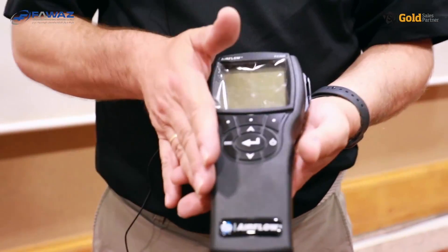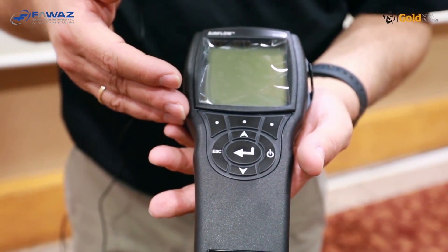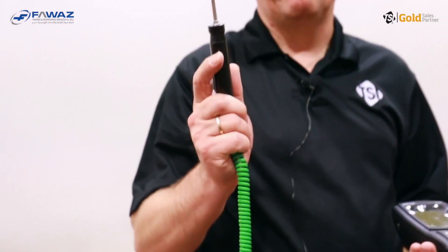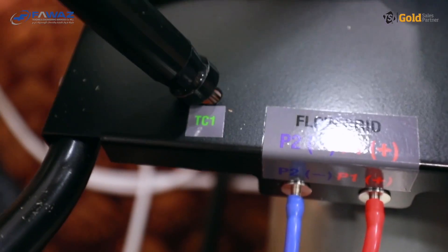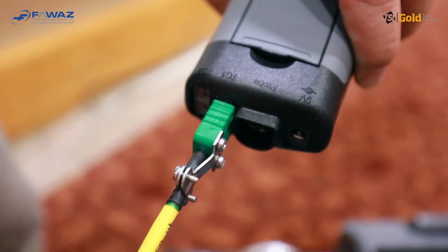The PANDA and the duct work are now connected together. The TA465 multifunction instrument contains the application used for duct work leakage testing. It compensates for air density by measuring barometric pressure with the included barometric pressure sensor, but it also needs a temperature signal from the air used for leakage testing. The temperature is measured with the included thermocouple, which you simply place in thermocouple port 1. The electric connection is made on the bottom side of the instrument, and it doesn't matter which of the two ports you use — both work.